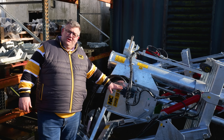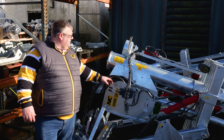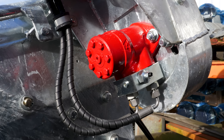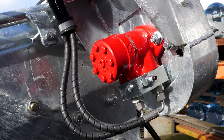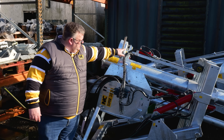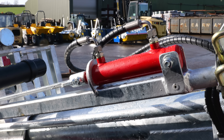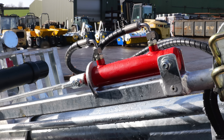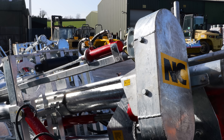This one is a chest-mounted hydraulic system. You have your two levers here on the side of the pump — your rotation is done by a motor, so you pull your lever to go one direction and pull it the other way. The second lever is for your spout — you have a hydraulic cylinder on your spout for moving it up and down. You can throttle the tractor down a little and the hydraulics will move it around, because under full power you'll never move it manually.